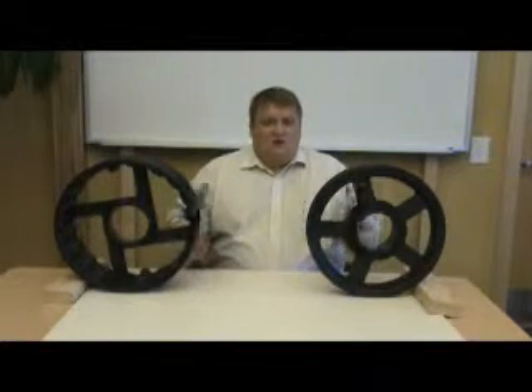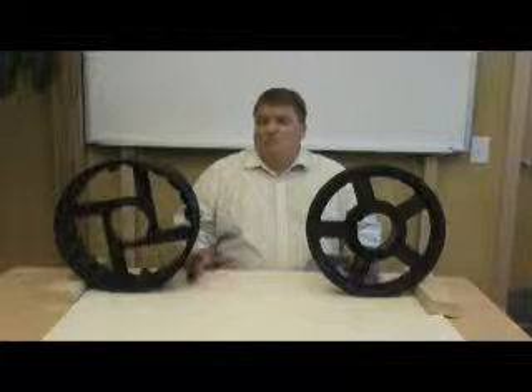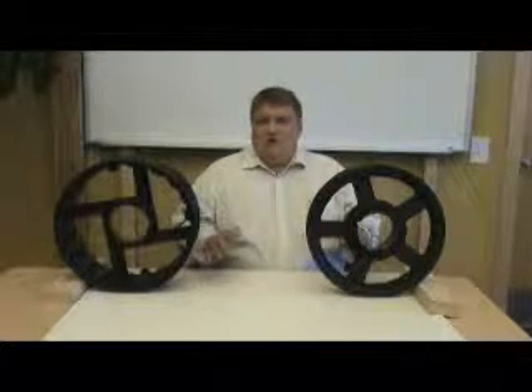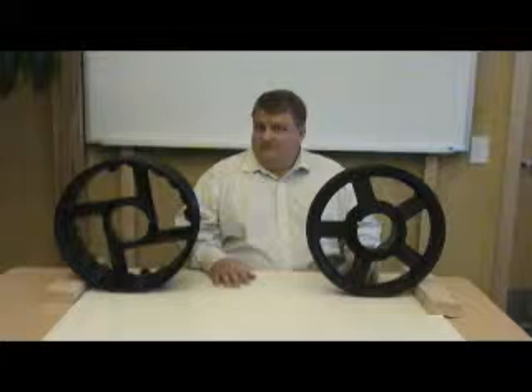Where might some problems lie? For one, conventional drives are pretty heavy — so who cares? Well, there's one nasty effect of additional mass: the moment of inertia. The higher it is, the longer it takes for a belt drive to come up to speed. For instance, if you have a heavy mass on the driven piece of equipment, not only will it take longer to get up to speed, but also it will most likely cause belts to slip on the driver's side.